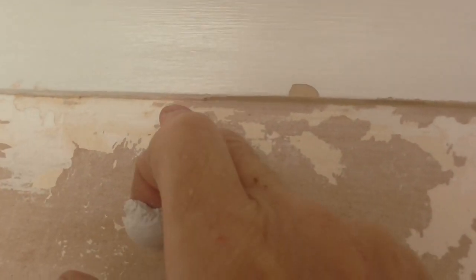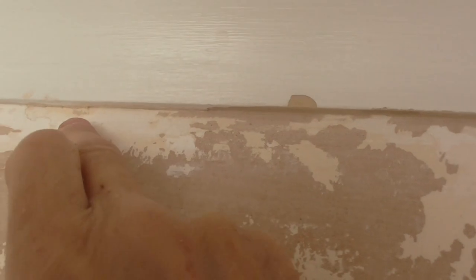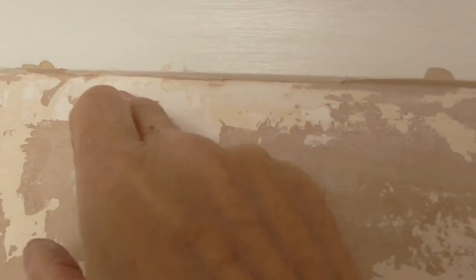When it comes to this line under the coving there, it's quite rough. You could get away with just papering it if you were going all white, but I'm actually cutting the colour in eventually. So to make sure that edge is as neat as I can get it, I've actually polyfilla'd it underneath. What I'm doing is using my finger with some polyfilla on there and just wipe it along that underneath edge, getting it as smooth as you can. Don't leave any lumps of filler - just rub it across them little bits where the paint's coming off, just smooth that edge off. And when you come to give that a light sand, that'll be perfect.